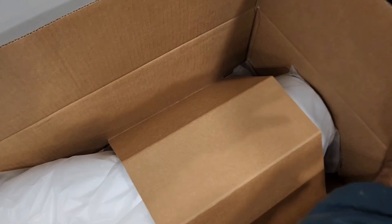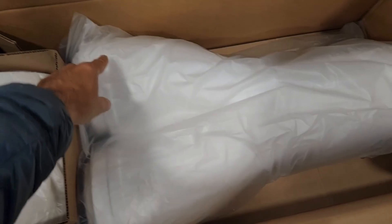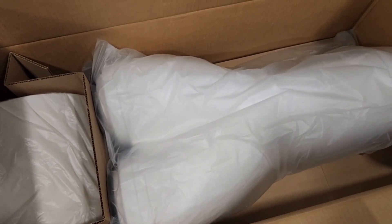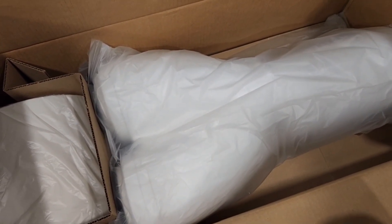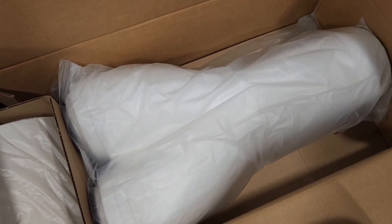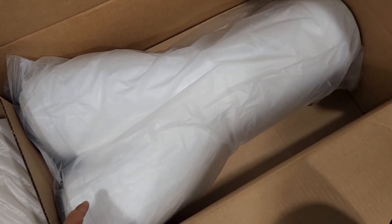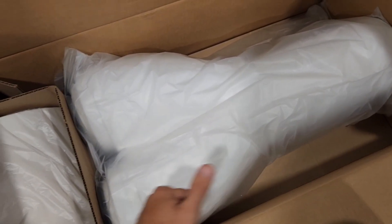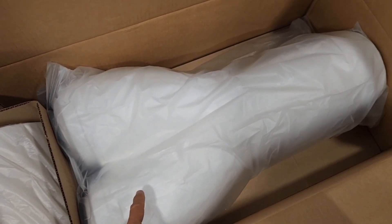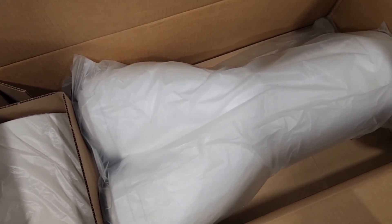The issue here is that this is just a big piece of styrofoam. Here's the styrofoam and there's the wall cap. This distance is way too wide for the floor joists that you actually have the unit in. So if you're thinking about having a sleek profile and having it go right out, staying up in the floor joists, it's not going to work. You actually need to buy the smaller one for the discontinued model — the smaller wall cap vent for the discontinued model — to get this thing to even fit up in that space.